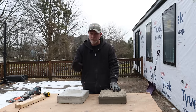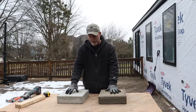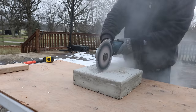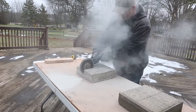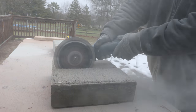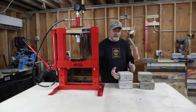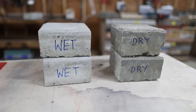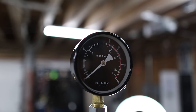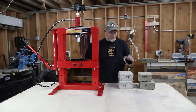I am so curious as to whether or not these have cured all the way through. We've got our wet pour and our dry pour sample pieces that we just cut — six inches by six inches in dimension and three and a half inches thick. This is a ten-ton press and I've got a couple of GoPros set up to capture the pressure gauge when pressure is released, because once that concrete cracks the pressure should release. Let's start with the wet.